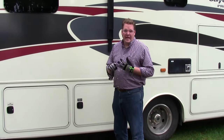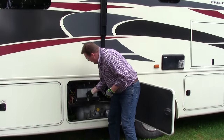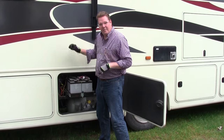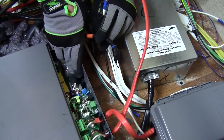Next step is to install the DC cables and provide DC to the inverter. In the battery compartment, all we need to do is take the positive and negative from the batteries to the inverter. We do need to stop at a fuse first — make sure the fuse is within 18 inches of the positive terminal of the battery. We've already pre-installed the DC wiring; in the original intent we were going to put in a 1,000 watt inverter, so we are using smaller cables than you would normally use for a 2,000 watt inverter. We are fusing it and loading it as if it's a 1,000 watt inverter, which is fine. When we upgrade to include the microwave, we will run the larger DC cable. To match the existing DC wiring: black is positive — that's why we've got the orange tape on it — and white is negative. Here we have the positive lug and the negative lug. Don't forget the chassis ground.